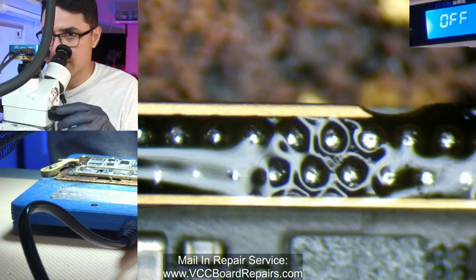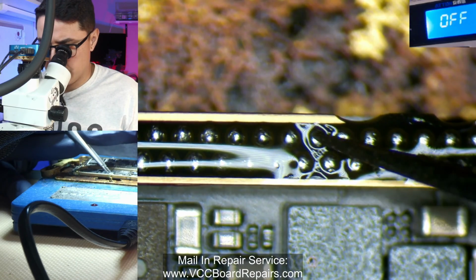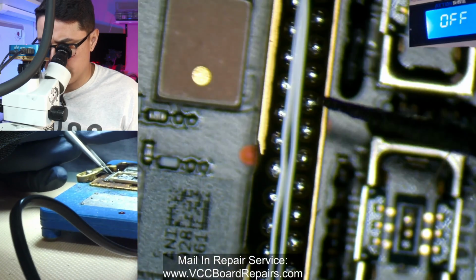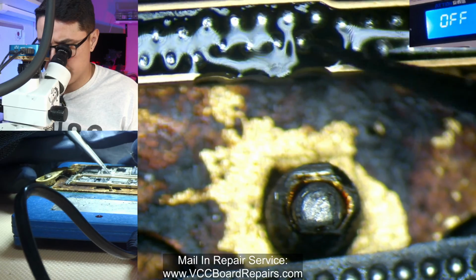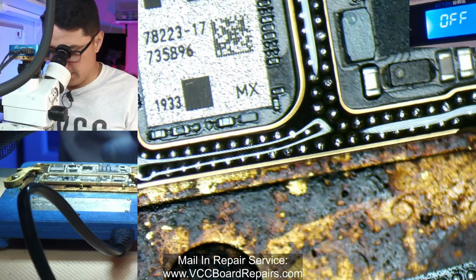You can see here, let's see, these solder joints are molten. Okay, they're not molten. All right, that's good. I don't want them molten. I just want it hot so the flux spreads, but not molten. You want to push them and nothing happens. Because now I've got to put the sandwich lid back on.